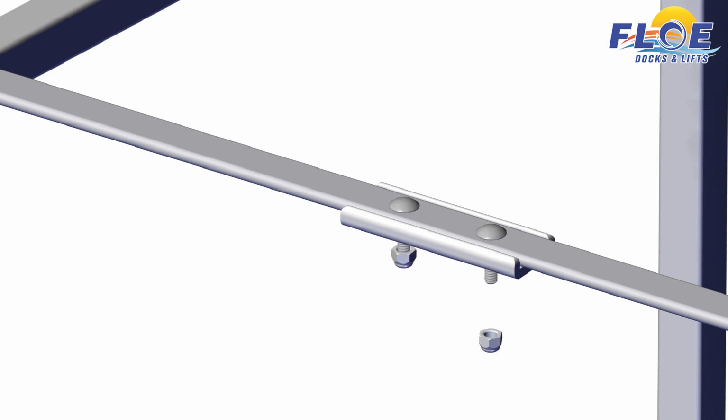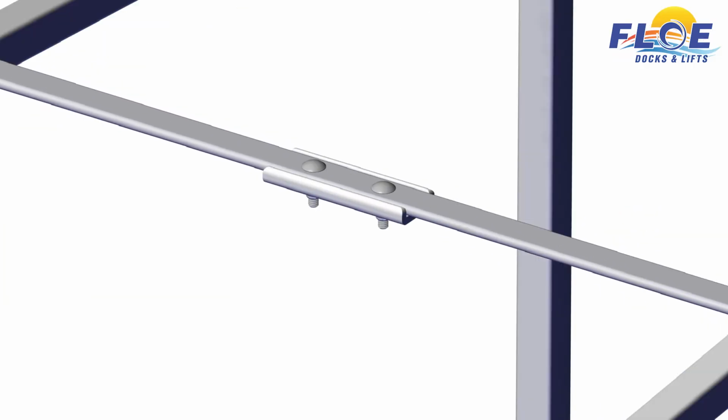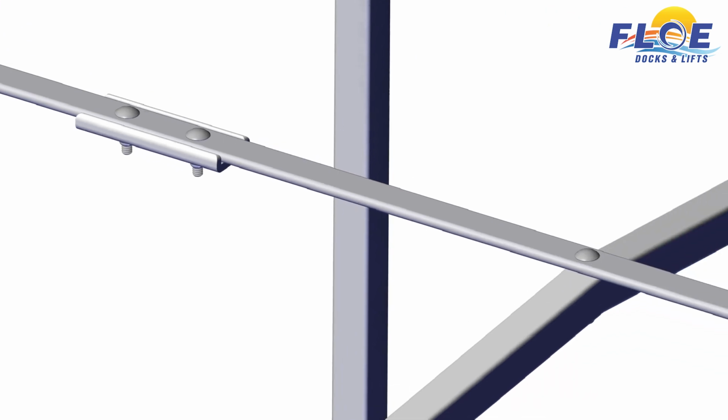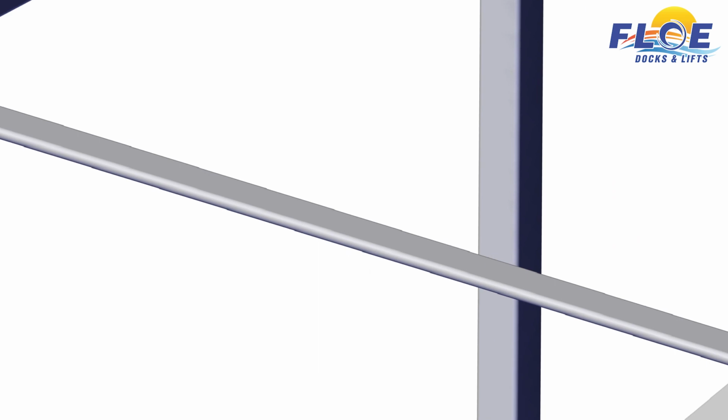Continue to support the rail to the canopy hoops, using 1.5 inch carriage bolts and nylock nuts. When you reach the end of the long support rail, add another splice channel and a medium length support rail. Secure the splice channel with 1 inch carriage bolts and nylock nuts. Continue to support the rail to the canopy hoops, using 1.5 inch carriage bolts and nylock nuts.